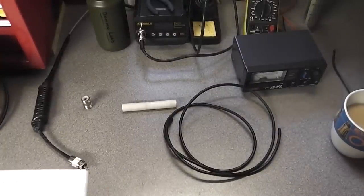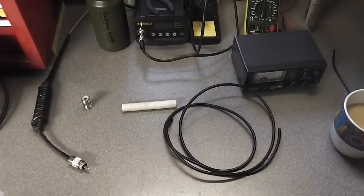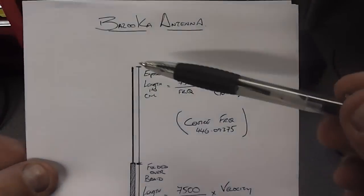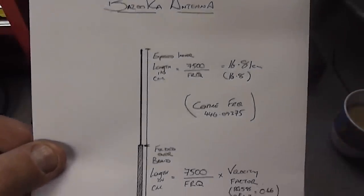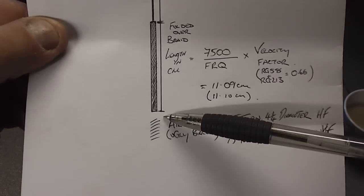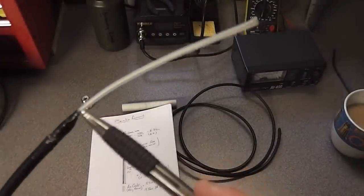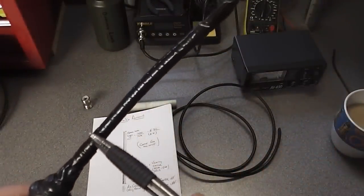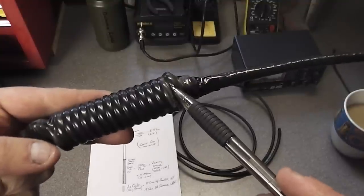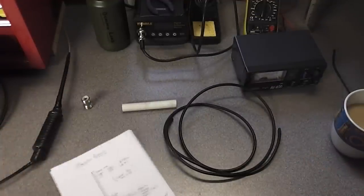To get into the dimensions, you need to know how to make the twig itself. Those of you who've made a bazooka or a T2LT for 27 MHz CB will be familiar with the specs. Basically what you've got is an exposed inner conductor, a portion of the outer braid which is folded back on top of the coax, and at the bottom you've got the balun. The balun is a 15-turn balun on a three-quarter-inch diameter former — that's the basic anatomy of the antenna.